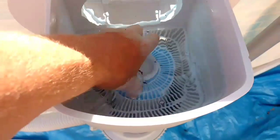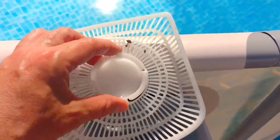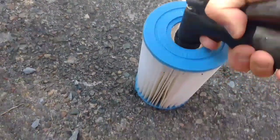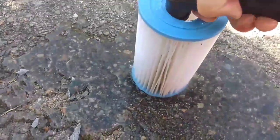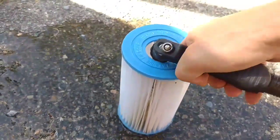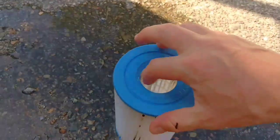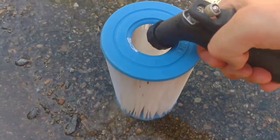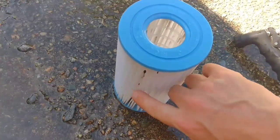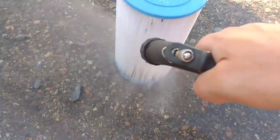I clean the filter on a daily basis. To take out the filter, it's just as easy as pulling on the screen. You want to keep this screen nice and clean — it usually collects the larger debris. So I have my garden hose here. I'll spray inside the filter and you can actually see the dirt coming out. It's a lot of the fine debris that gets stuck in it. I'll spray all around on the inside of the filter, then flip it over and do the other end. It's amazing how much will come out. If I don't clean this after a few days, it will start to get quite brown on the element. Then I'll spray the outside of the filter to get a lot of the larger debris that's caught.